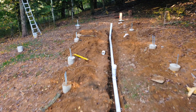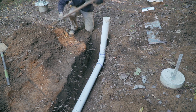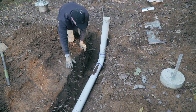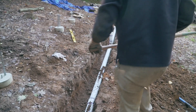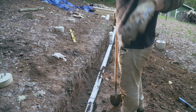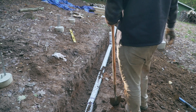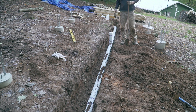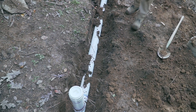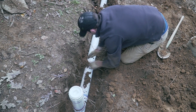I'm done setting my sewer line and pretty much ready to backfill it. I dug too much at the bottom, so I need to add soil and shove it below the pipe — otherwise it would just drop once I backfill. I'm backfilling a little bit so I can compact the soil around the pipe, because I want it to be constantly supported the whole way. I'm pretty lucky my soil is soft with no rocks. If your soil is bad and you have mostly rocks, you might have to lay a bedding of sand below the pipe.